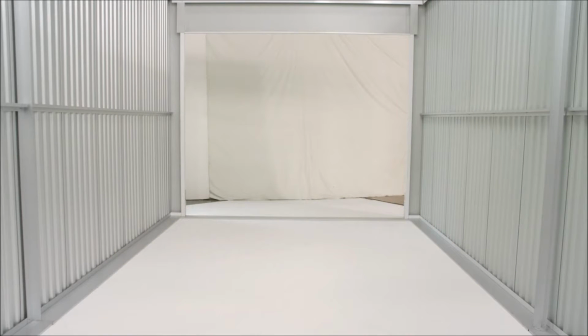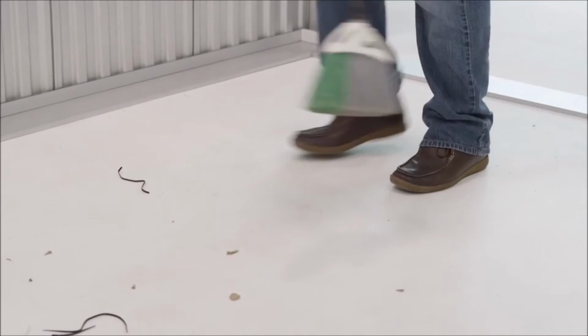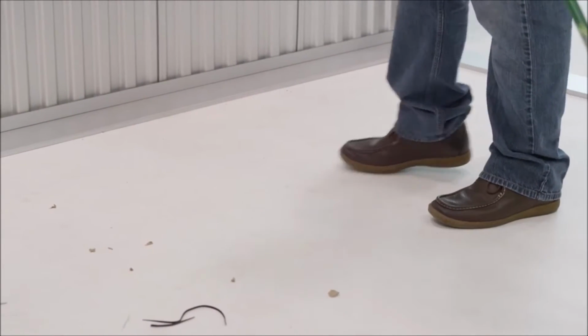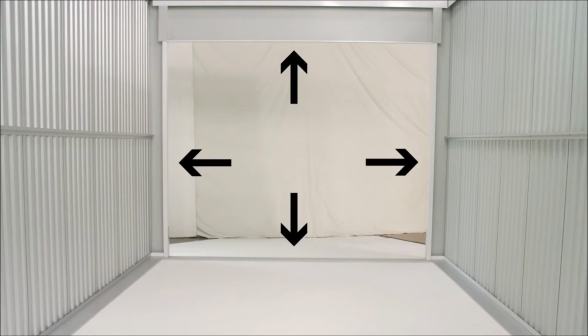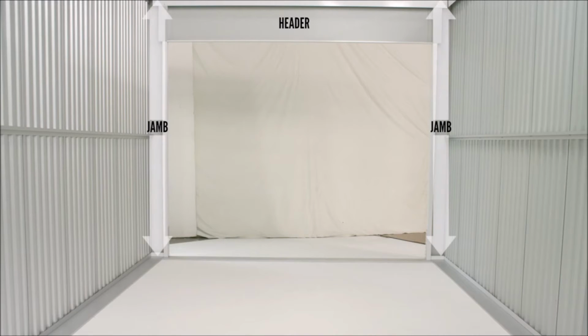Prior to installing a door, you'll want to go over some preliminary steps to ensure a smooth installation. Also, you'll want to check to see that the floor is level and clean, to give yourself a neat working area and prevent damage to the curtain. Check the wall opening width and height and verify these measurements against the size of the door to be installed. Verify that your jambs are flush and plumb and that there is adequate side clearance for the opening and at the sides of the header. If the header is already present, make sure that the header is level.